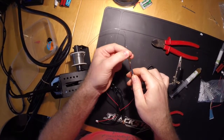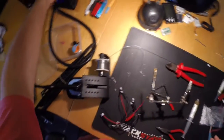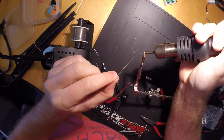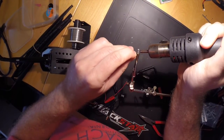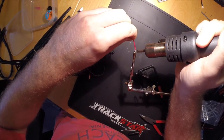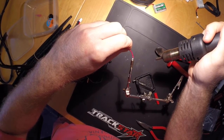Next step is to connect two bullet connectors for the main charging connection. I put the connector housing over the wire and then apply some flux gel. Now heat up the connector — since that needs a little bit more heat than those tiny ones, I've set the gun to 480 degrees Celsius. Now simply fill it up with solder, make sure it stays all nice and hot, and then just stick the fluxed wire in. Make sure to keep it steady for a while because these bullet connectors retain a lot of heat — 10, 20 seconds and good.